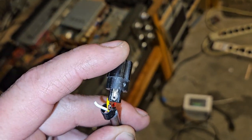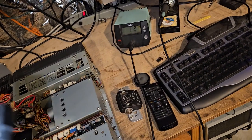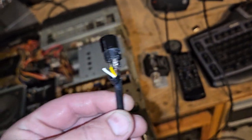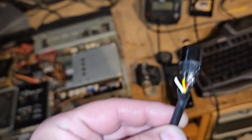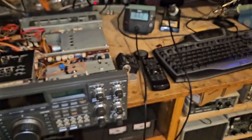There's one that's never been soldered — it apparently just sat there. So we'll just turn on the iron here, heat it up, and get in here and tack it in there. We'll get some flux on the end of it and then properly solder it. How's that sound?